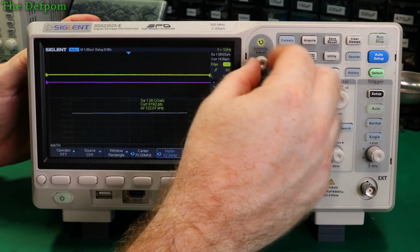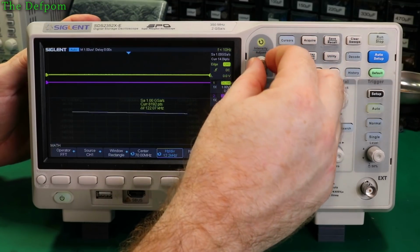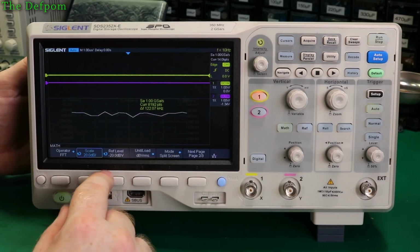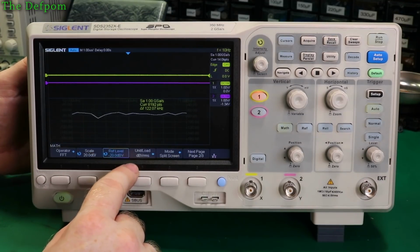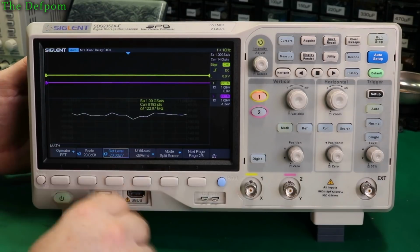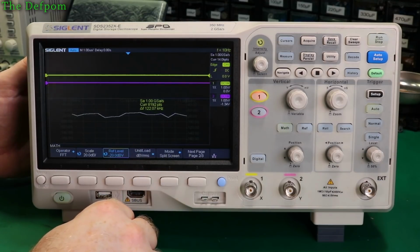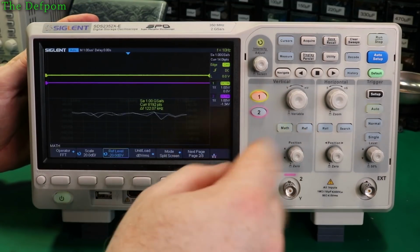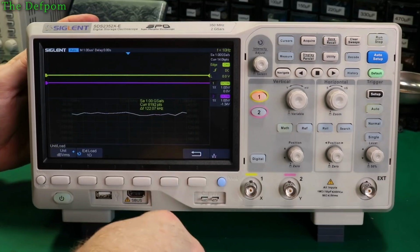Alright, so you can go right down to 12.2 kilohertz per division. Scale dB. You adjust that range, reference level, so you can adjust that one. It shifts the range on the display. Hope you can see the graticule okay. It's quite bright around here. I think I did actually have it turned up, but I might have to look at that. Make the graticule a bit bigger.